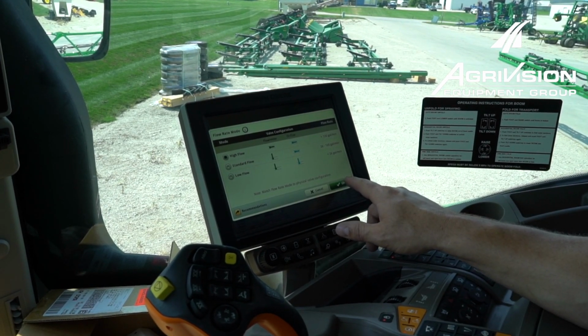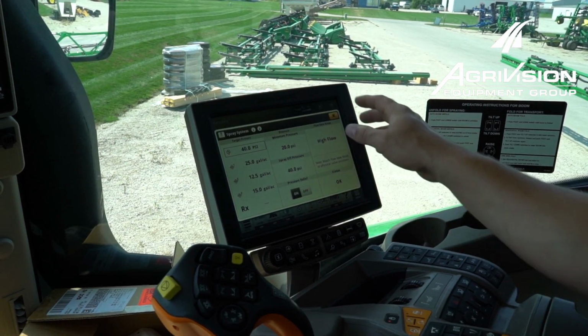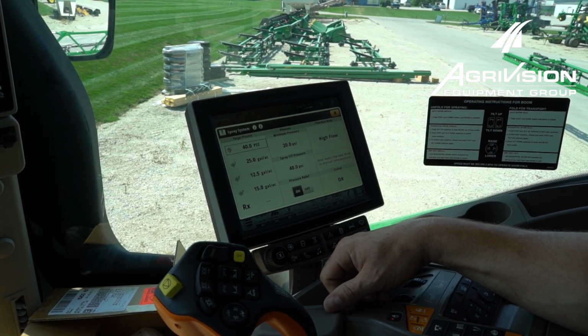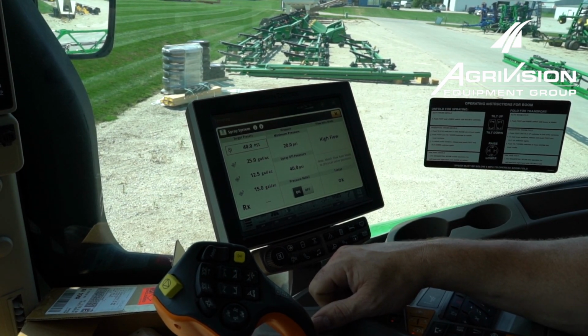That way it'll read that flow meter. Another thing I wanted to show you was to make sure that we've got adequate minimum spray pressure and spray off pressure. 20 and 40 will be fine for our winterization, and then we're set on manual spray pressure here.